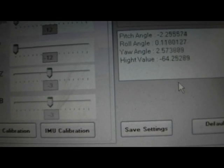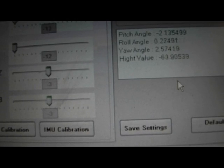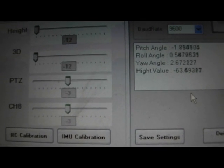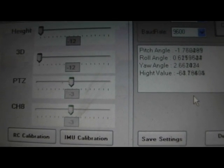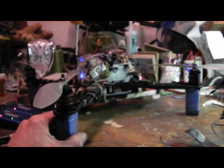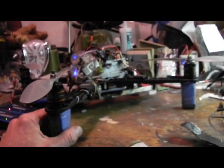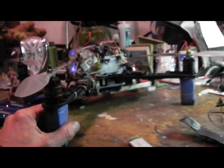And I've had the front, or the top number, the pitch angle, also set to 0. And what's happened is I've gone out and I've had extreme drift way beyond the control trim level on the controller, and I had to reset it, calibrate it with the feet on it, on the most level surface I could find in the hallway, and it hovered perfectly and locked in with the baro and maintained altitude as well as position left to right, forward to back.